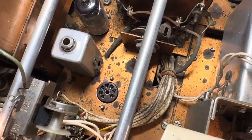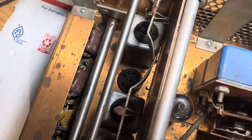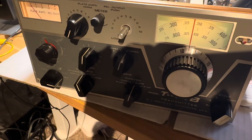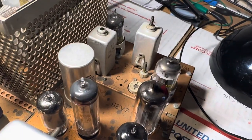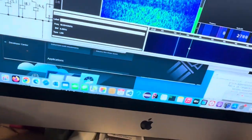If I had a mixer tube, I could see if there are ham band frequencies coming out of this thing, but I have no mixer tube and no driver tube yet, so I've got to wait for those. But it looks like what I can test on this thing is working, so that's a good sign. I could probably check the oscillator — that's going to be around 9 megahertz.